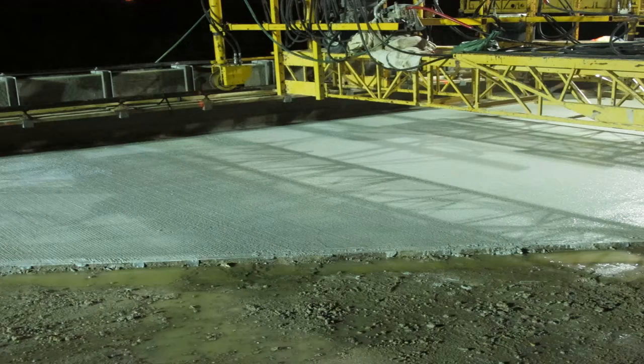Square up the machine so that the rollers are square to the rails that the carriage rides on. The machine needs to run perpendicular to the parapet and not on a skew. When setting up the machine rails, make sure to run them off the bridge and have the finishing machine run the entire length of the bridge, including through any short skews at the end, and completely off the bridge. Another tip is to pour your HPLMC downhill when possible, so that the very flowable LMC does not have a tendency to roll back up behind the rollers.